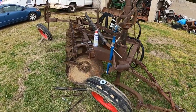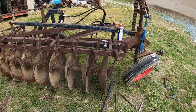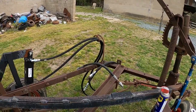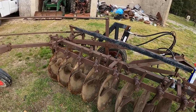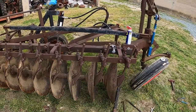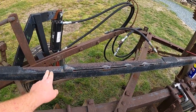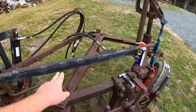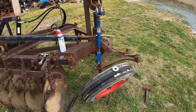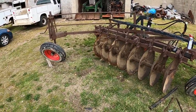The hydraulic conversion basically does the same thing as the trip mechanism — this is a repeat for some of you guys — that lowers the disc plow to the ground. Then you fine tune your depth with the front handle, which has several notches in it. I showed you the back handle up and down. I could never get the plow disc sitting level because of that top brace. Cousin Scott from Small Farming Things brought that up to me a long time ago — the pieces of angle overlap and it had a bunch of bolt holes in it, and that was your adjustment to keep your plow level. When I took that away with the hard welded piece, it was all out of whack. That top link is going to give me even more adjustment than the bolt holes, and it'll be a whole lot easier.